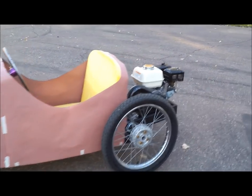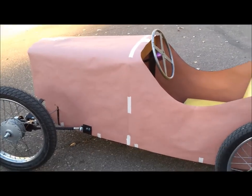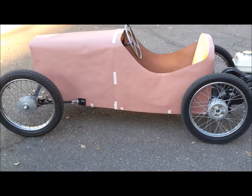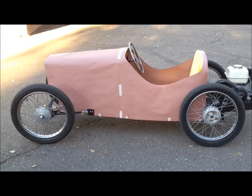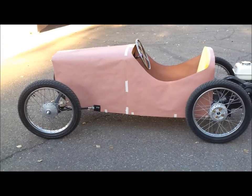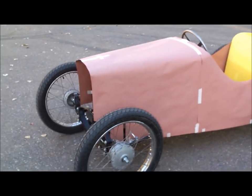The biggest challenge I have will be building the rear cover, but what you see on the cart right now is rosin paper — painters use it, it comes in a roll — and I'm using it to create initial templates. I made a pattern last night of this side, then taped it all together until it was just right, and then I used it to make this version. So each time I make a pattern, it gets more refined.